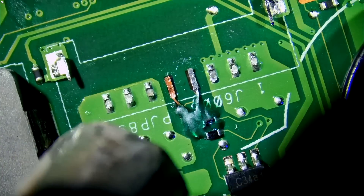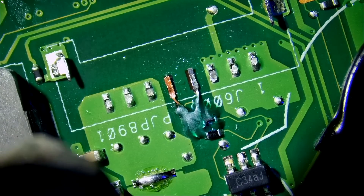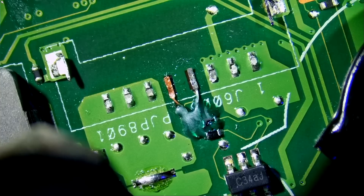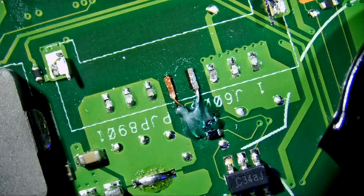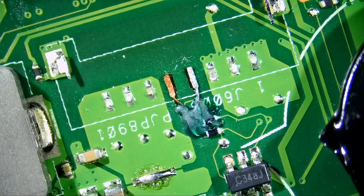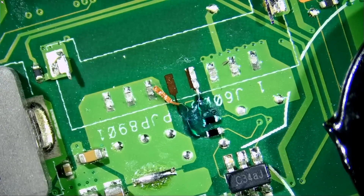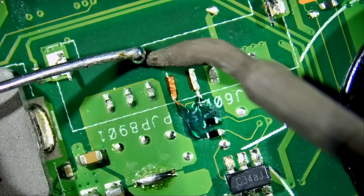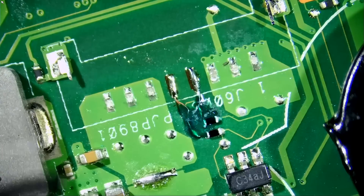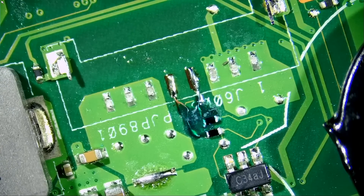What I also like to do is apply hot air along with UV light. I went over this technique in a previous video — you can look up Northridge Fix UV mask. Hot air helps with the curing of UV mask. Just like that — now we can grab the customer's connector and hopefully that connector is good.